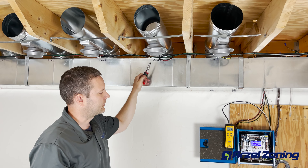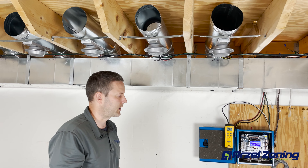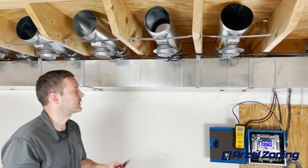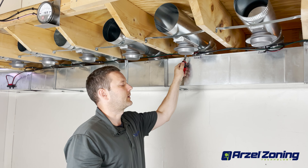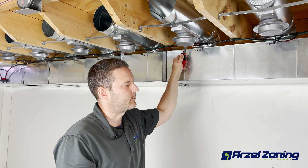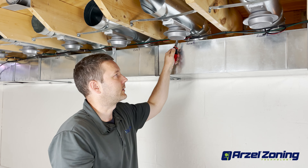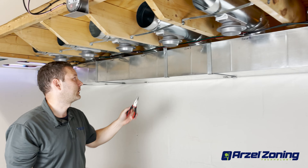So next I'm going to continue. I'll release that — my pump noise gets loud again and my pressure drops, so I know I've got another leak in the system. I'm going to move on to the very next damper. I pinch it off after that damper and give it a minute. I can hear my pump noise changing and I can see my pressure increasing. I know that this damper is good, so I'm going to continue moving down the line.